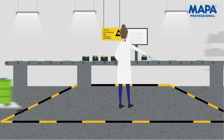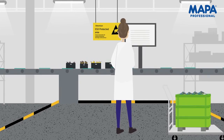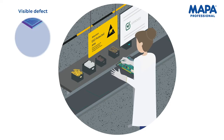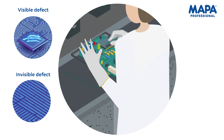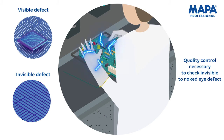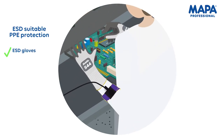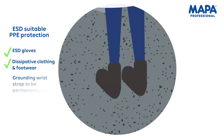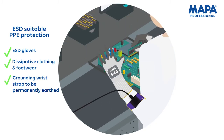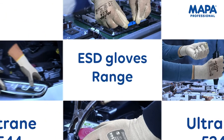In some critical production environments, electrostatic discharges can damage or weaken sensitive electronic devices. Some damages can be seen clearly, but most of them are invisible to the naked eye and can only be detected under a microscope. That's why wearing the right PPE and quality control are essential. Wearing ESD gloves alone is not enough. Workers must wear suitable dissipative clothing and footwear, as well as a grounding wrist strap to be permanently earthed. Having the right glove is then essential.